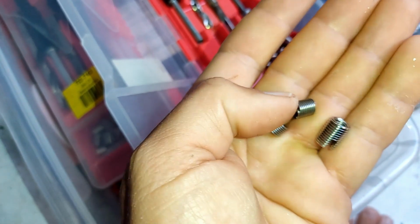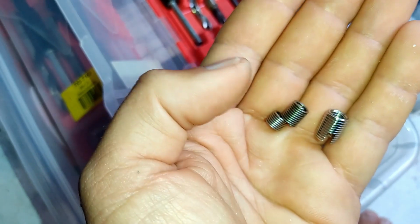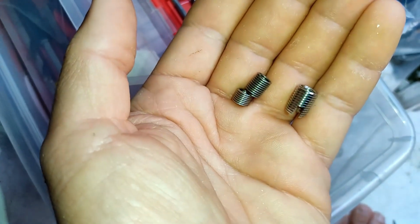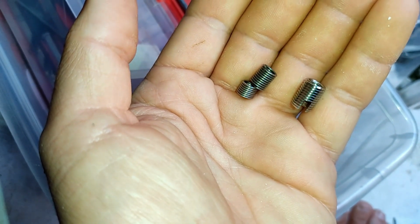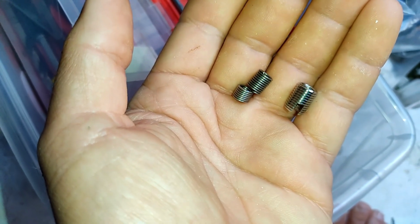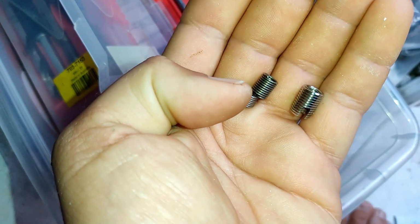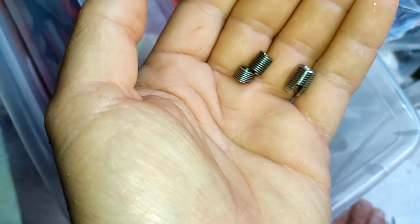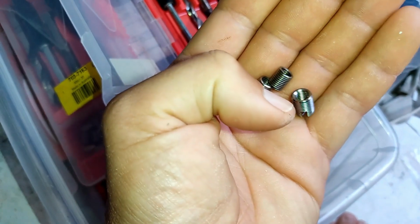So that's the other advantage of these stainless steel thread certs, and why we use them on parts, particularly where the bolts will come in and out and on and off, and parts to be serviced, like I was saying before, the gate of the mast track, where we remove the sail track on the mast to put the sail on. Quite often, the bolts are coming in and out fairly often. It'll see a service life of bolts going in and out 20-30 times. So a metal on metal style thread is much better than a metal bolt on a composite hull.